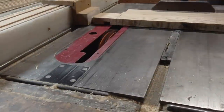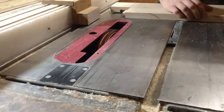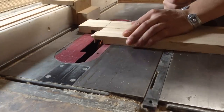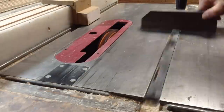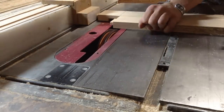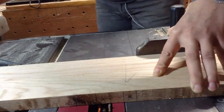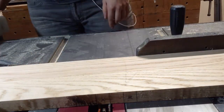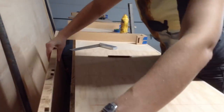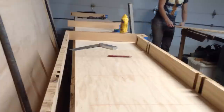Because the drawer boxes are going in place, it's really important that these sides are square and are the same distance from the edge front to back, or all the fronts of my drawer boxes are going to need tweaking. It's a series of — I think there were eight dados on the front and the back. I'm just moving the fence over and I can cut all four of one at the same time, lining up with my marks and sending it through each time. Now this process makes a little more sense: I can take these apart and you can see the back with all of the dados, and the front with all of the identical dados because I had them clamped together and was cutting them at the exact same time.